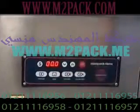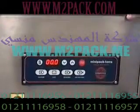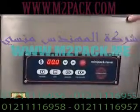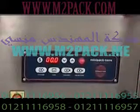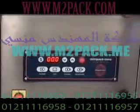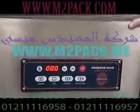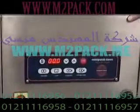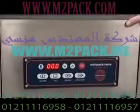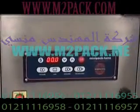Now the gas is a feature if you have a gas line or a gas tank hooked up to this machine. If you're going to be vacuum packing potato chips or something that's fragile and you need to leave some air inside for preservation purposes, you can hook up a nitrogen air tank, for instance. You can shoot a puff of nitrogen air inside of that bag, and that'll help preserve the food even longer. If you leave about 25% of the air inside and you didn't use nitrogen, you just use oxygen, that leaves a little bit of air in there for bacteria and other items to grow, and will decrease the shelf life of the product.